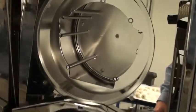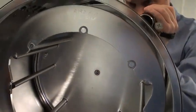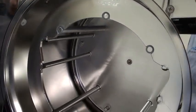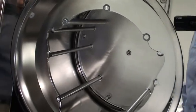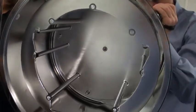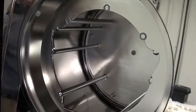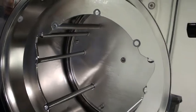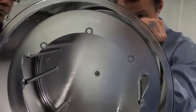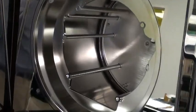I'm going to just focus in on the chamber here. We've manufactured a brand new rotor. The rotor has been balanced to our customer's cassette and wafer loads, and when that is done we have essentially zero harmonics and very smooth operation. So all our rotors are brand new. Of course, the bowl, as Frank just mentioned, has been sent out and been professionally electropolished.